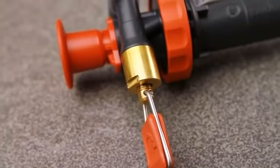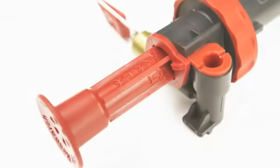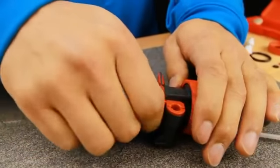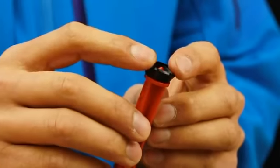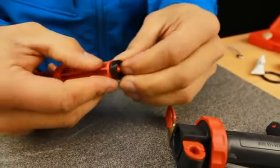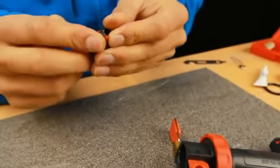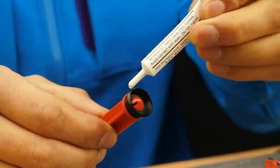If you have trouble pressurizing the bottle, check the pump cup. To do this, you will need to remove the plunger. Pull the plunger out to expose the text marked open here. Now rotate the plunger a quarter turn to the left and pull it out completely. If the pump cup is cracked or damaged, then replace it with one from the Expedition service kit. If the pump cup is dry, simply apply some pump cup oil to lubricate it.